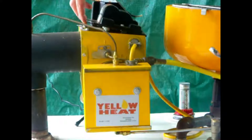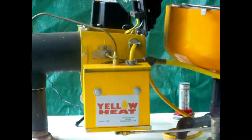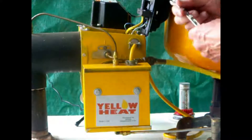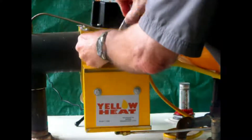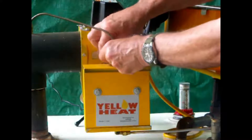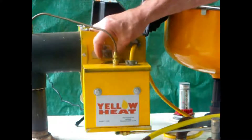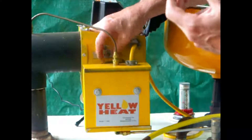This is the sparker — the igniter, as it's called. There are some springs underneath this cover, and if they get caught, you can push them a little bit and they come free. There are two steps to taking the electrodes out, because the electrodes can build up some carbon and may need to be cleaned with a paper towel. The first step is to unscrew the pressure fitting — just a couple of turns will do it. That's where the compressed air goes into the Yellow Heat burner, and it comes off with your fingers. The second step is there's a knurled ring, which comes off with just finger pressure — a few turns. Then the whole electrode and the patented Babington ball burner head come out — I'll show you that. The drawer, as it's called, wiggles out like this.